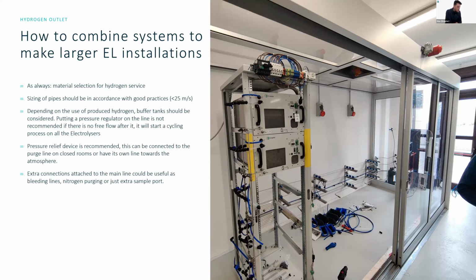Catherine Prince is asking, do the electrolyzers have built-in conductivity sensors? Can they provide measurement values of the absolute water conductivity? No, our electrolyzers do not measure the input water conductivity, but we can tell essentially from analyzing telemetry of the system if there's been bad water supplied to the electrolyzer in recent times. Therefore, it's very important that either system integrators take care of the conductivity measurements and monitor these values, so that no bad water is supplied to the systems, or to use the water tank module 2.1, where there is a built-in conductivity sensor. That way we can be sure that the systems are not being supplied with bad water.